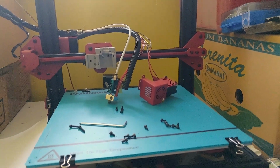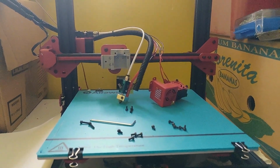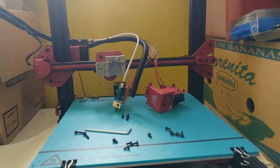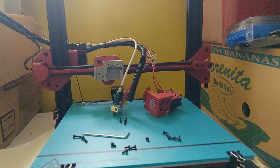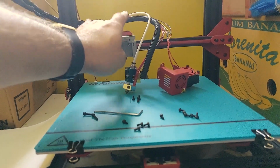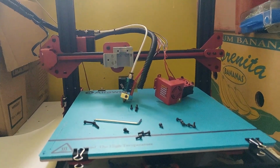Okay, as you can see, I've now got a base plate fitted. This is to fit the Pet's Fang duct, and it's also the clamp for the e3D V6 heatsink. I will post links to everything I've used down in the description. It's just held back with some M3 screws. I did have to put a couple of M3 screws in these two holes, because that's where the front part of the clamp goes on. Tightening those is going to be a little bit fun, but we'll see how it goes.